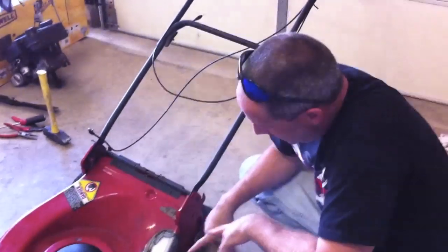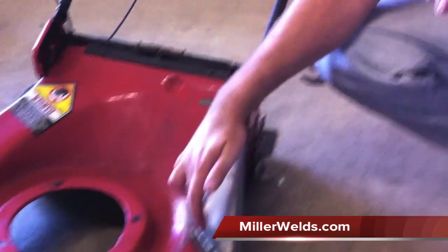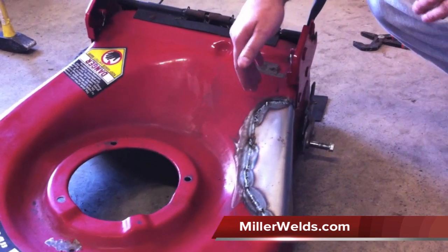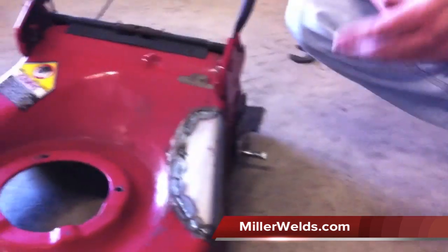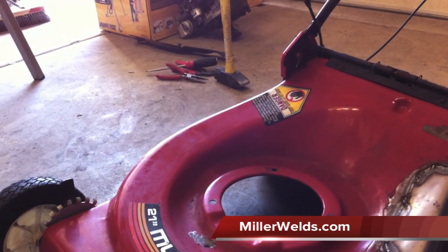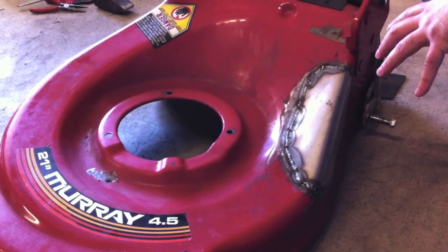Alright, went ahead and did the welding on it. You can see my hack job — it was my very first welding job. I definitely learned a lot. For one thing, I probably should have cut more of the metal out when I used the plasma cutter. Some of it was a little thin so I burned through it faster than normal. I tried the pull method and the push method — certain times one was better, it was just kind of hard to really gauge. But for my very first welding it probably doesn't look too pretty. I learned that it's not only a science to it — it's definitely an art to welding.